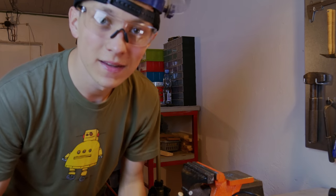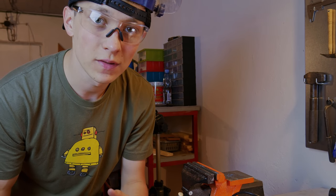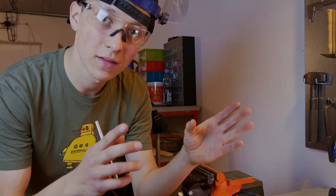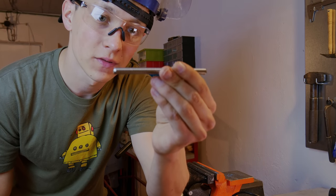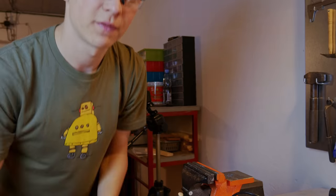If you are building a CNC with exactly the same dimensions as I do, you don't have to buy two separate lead screws for the z and x-axis — you can just buy one that is 40cm long. Measure and cut a piece for the x-axis, and what's left is almost perfect for the z-axis. I just have to cut like 5mm off that and it will be perfect.